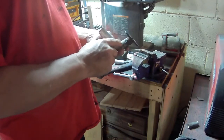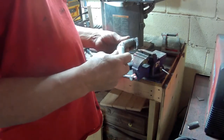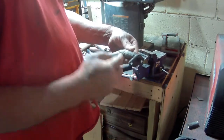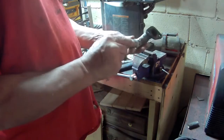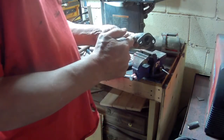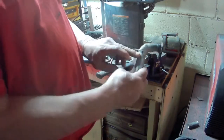So there's my kink from the first bend. I actually did end up making two slices — one here and one here — to get the proper curve. If I hadn't done that I would have had too many kinks. This way, once I grind it down, it looks like a better curve.